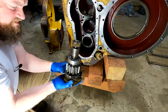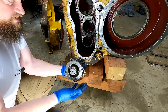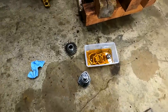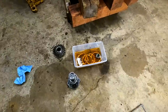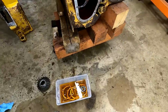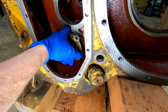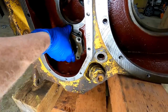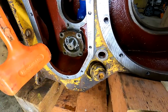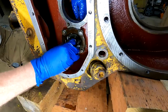As I said at the beginning, none of this is cleaned up yet, so I'm going to clean it as I put it on — starting with that shaft and then that shaft. First step, I think this is the last thing I took out was this shaft. This bearing looks fine, there's not any play, so I'm just going to hose it off and then just stick it back in. I'm soaking this stuff in Royal Purple or Simple Green or whatever — a colored degreaser. Then I'm blowing it out with compressed air and soaking it in some gear oil before I put it in. It's not much to it. The smell of fresh gear oil — something this machine probably hasn't smelled in quite a while. This thing spins nice — it's a good sign.